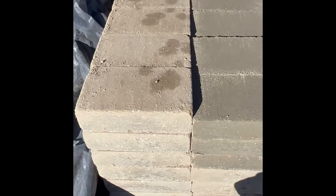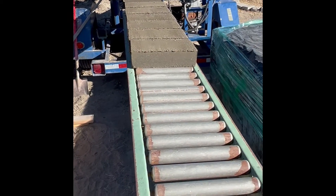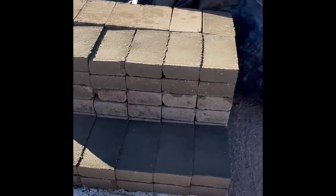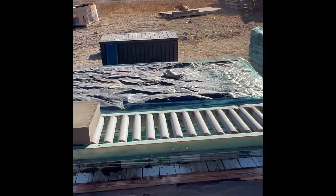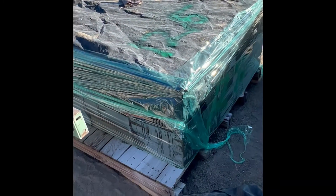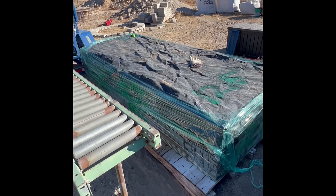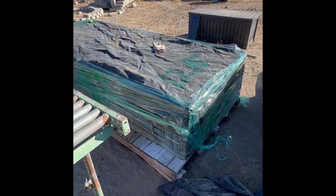You can already tell they're starting to harden up nice. People get confused that the cement doesn't take hold automatically — these blocks are still fresh, still wet, still kind of soft. You've got to baby them to the pallet. The cement's not going to do its thing until at least 24 hours later, and then they're going to continue to harden. Some other ones I made yesterday on this pallet are wrapped and going to cure over time. You can see the moisture in there — they're going to slowly dry out over the next few weeks and then be nice and ready for their application.